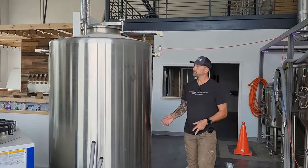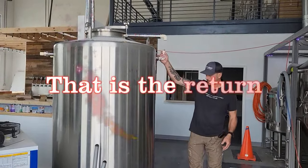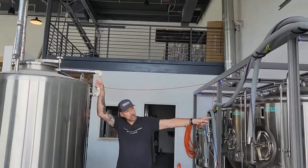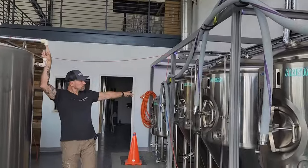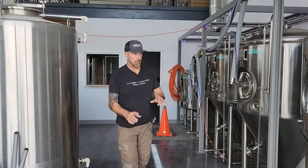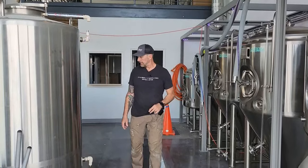When we chill our beer, it goes into the plate chiller like everybody else at home, but instead of water, glycol runs through the plate chiller and takes it down quickly. We can run wort through here at full speed into the fermenter and have it come out cold and ready for pitching. That's why we have this large 1,000-liter insulated storage tank. The glycol chiller has a closed loop inside which keeps that tank at whatever set point we decide — maybe 33 or 30 degrees. The output goes up and into all the inlets of all the fermenters via the brass solenoid.